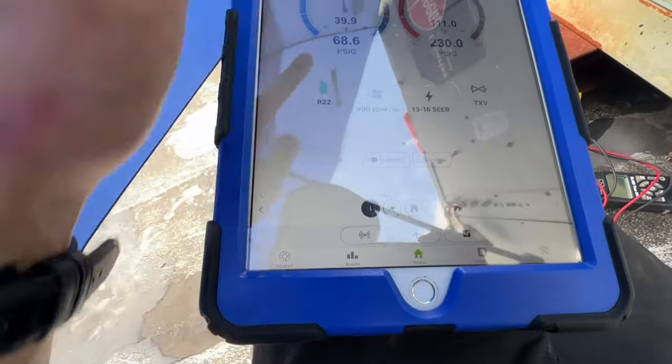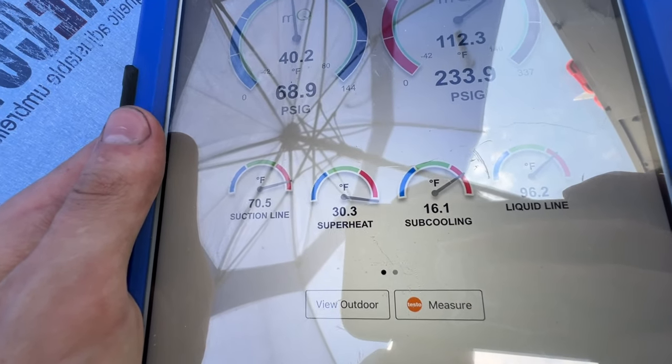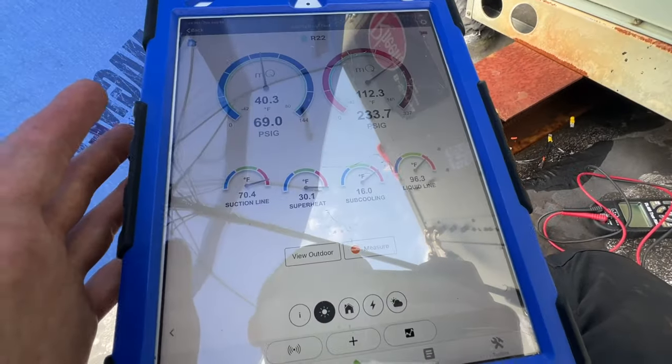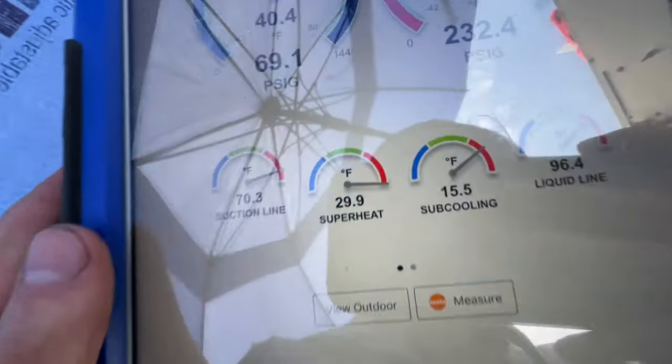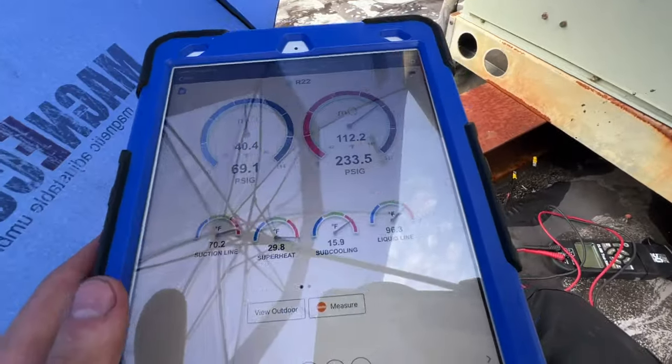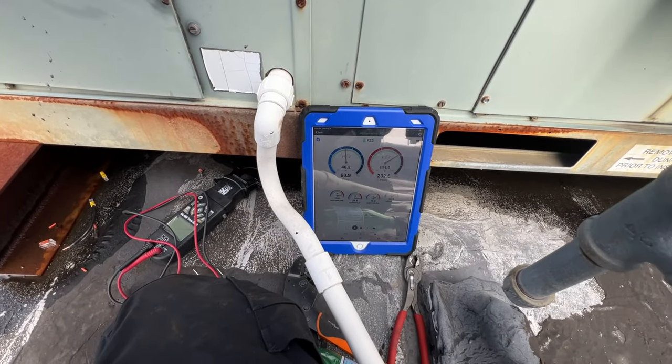The pressures are a little bit not the greatest. We have mid to high sub-cooling and fairly high superheat. I'm also reading it close to the compressor, but it is going down as it runs for longer. We had 34 degrees, now we're at 31 degrees superheat. Here's our pressures — R22. Superheat's dropping, so that's nice. We confirmed blowing 61 inside, returning 75 — that's pretty good for such an old system to be cooling by 14 degrees. The charge may not be perfect, but I don't want to add and bring that sub-cooling up and bring that high-side pressure up, especially if it's cooling. When I removed the filters, we're keeping them out and he's going to get new filters. Should be good to go here.